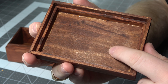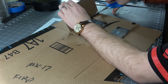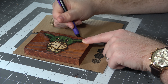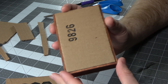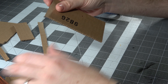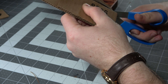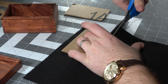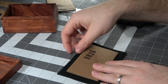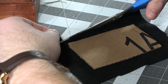You could absolutely stop right here — it's a perfectly fine dice tray and box — but I want a felt lining on the inside like most dice trays have. The way I found to make this easier is to cut out some cardboard, trace around the edge of the top dice tray, and cut on the inside of the line. I have to keep cutting and adjusting until the cardboard fits inside the lip. I cut out two pieces and I'm going to use black felt — I decided black looked a little more luxurious than green and the American walnut really deserved it.